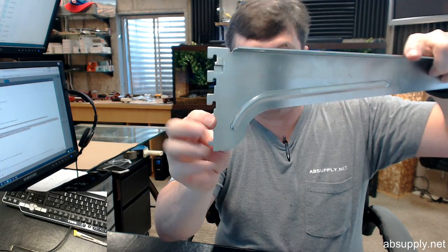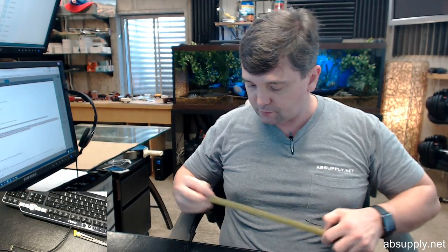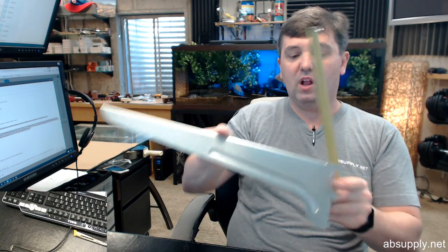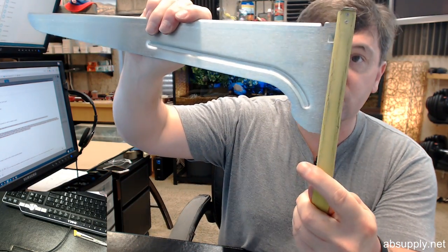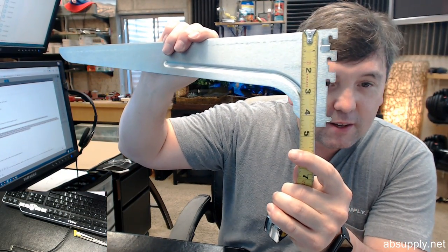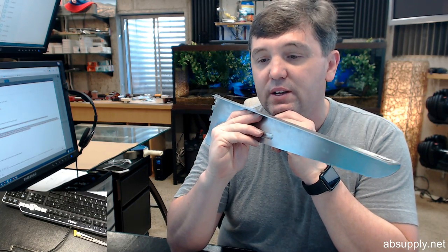Stamped Reeve there. This is their 81 series. The width of the flange on the top is about 7/8 of an inch. Overall height, back here where it's going to engage the standard, holding that tape measure backwards again, about 4.5 inch. Available, of course, in all of the common lengths from the 6-inch range out to the 24-inch range. The RV81, which is this bracket, is typically used in the RV20 and RV40 series standards.